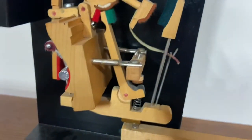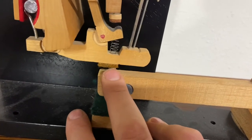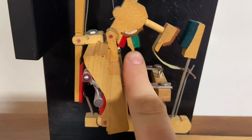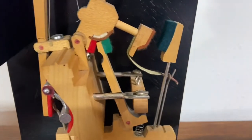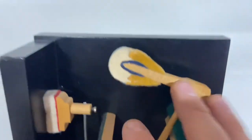Also, something that is important here is the key height, the capstan at the back of the key, and that controls when the jack touches the buckskin here, this leather here, which pushes the hammer. If this is too far down or too far up, you won't have the right amount of travel. Probably be pushing the hammer if it's too far.